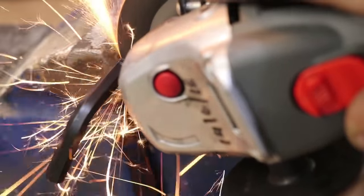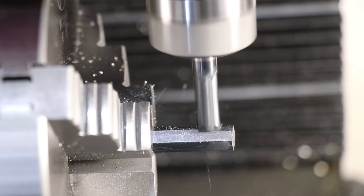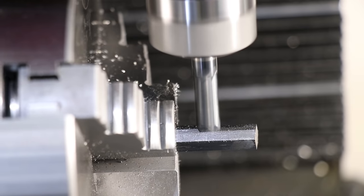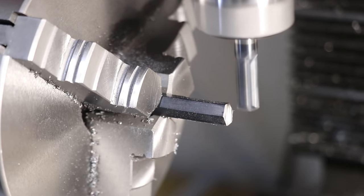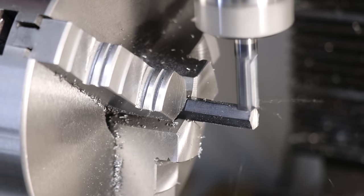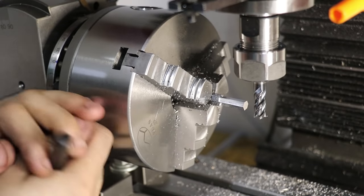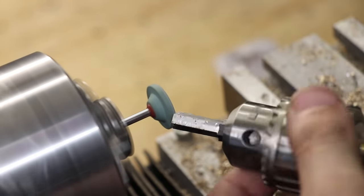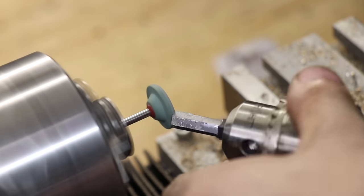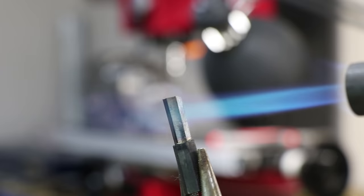I cut off one end using an angle grinder and I put it in the dividing head. The dividing head is facing down at a 3 degree incline. I'll use a carbide end mill to mill the hard steel — doing this will create the relief angles that I need for cutting. Now it's important to note that hex sockets are made slightly oversized, so this 8mm hex key won't be able to make an 8mm socket. Rather, I'm going to take it down to about 6.1mm between flats, and this will be able to make a 6mm hex socket. I'll mount a Dremel grindstone in the lathe and I'll use it to grind in a concave bottom to the cutter — this should make the cutting geometry a lot sharper and thus make it cut a lot easier. Finally I'll heat the part to red, quench it, and then temper it. This should harden the cutting edges.